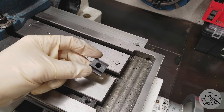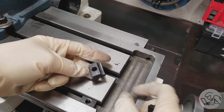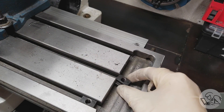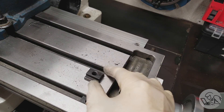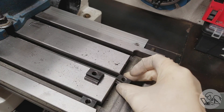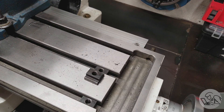What is a T-nut and why do we need them? Well, they look like this — they're T-shaped nuts that go in slots on mill tables, drill presses, lathe chucks, and lots of other things that have T-slots in them. Why would you need to make them? They come in different sizes that may not match your mill. Hypothetically, maybe it's a Sunday and there's some sort of global pandemic on and you can't get anything shipped.